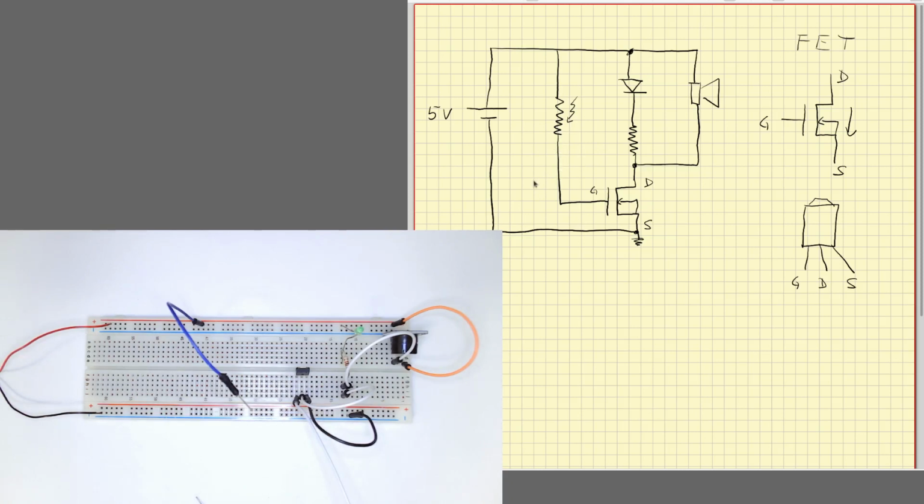use another resistor. So basically we are going to disconnect here. I can use another resistor here and then with this resistor I make a voltage divider here. I don't know yet, but I can calculate the value of this resistor so that with some amount of light, okay, the voltage here will be high enough to activate the transistor. But when there's no light, this resistor will make the voltage here to be low, and I disconnect this one.